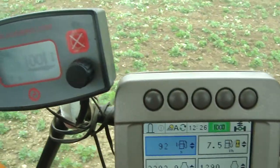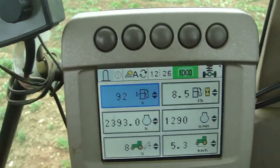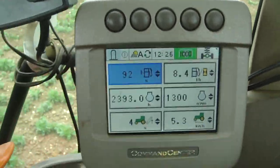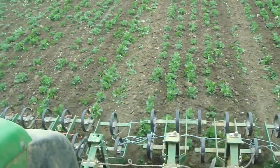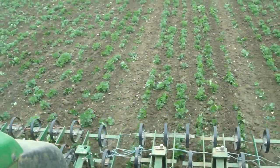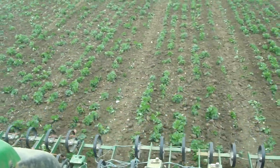We're going at about 5k at the moment and I've just slowed it down so I can do this little bit before we get to the end of the field. But usually we'd be hoeing around about at this time of the year probably about seven and a half k, and then when the crop's a little bit bigger we get up to about 12k. So it's a bit slower at the moment but I think it's doing a good job.